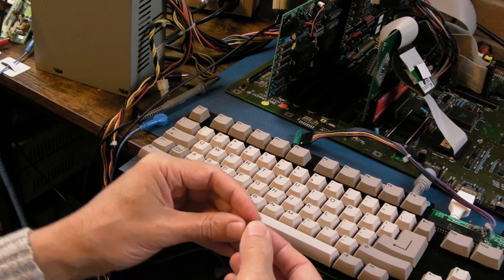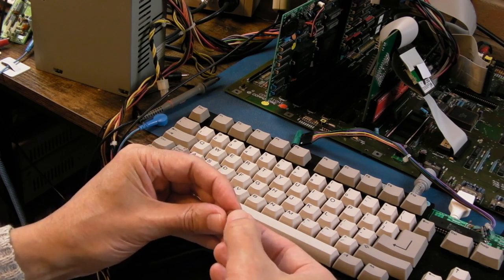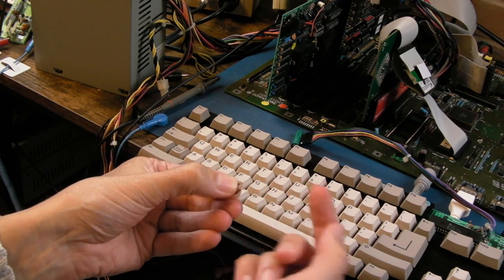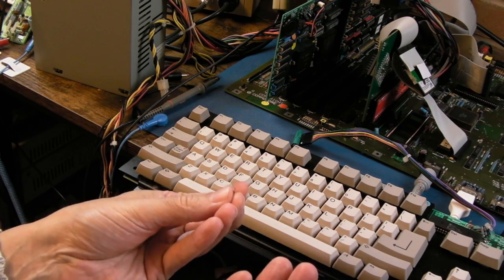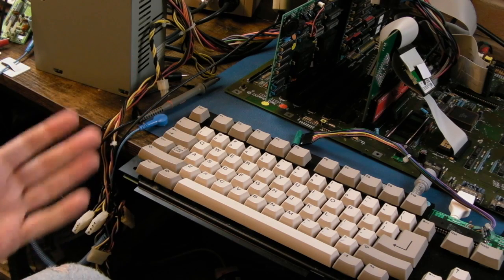I probably just made a load of mistakes explaining that, it's just based on what I remember, but the way I was told is about loading. If you load something like this down with about 20 odd picofarads on each side, it's usually enough to get it going, and that's exactly what we've done here. Yeah, with the 22 picofarad caps, it works.